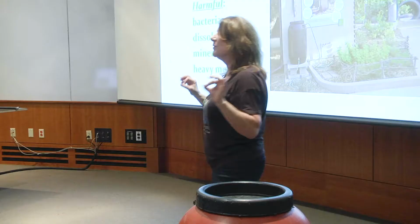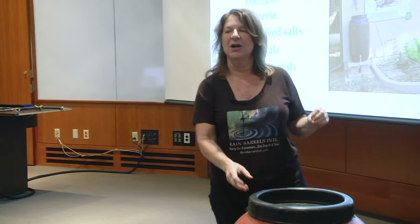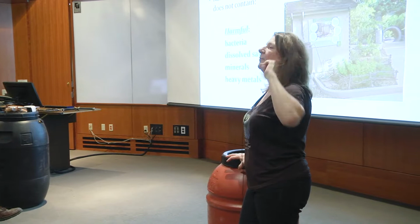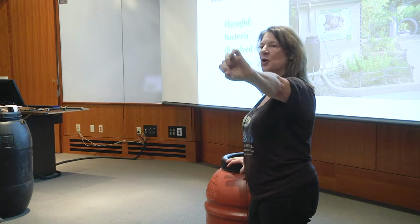But what we would really like to do is have you keep the water on your property. So what we recommend to people is attaching a garden hose to the barrel. And that way, pulling the garden hose away from the foundation of your house, okay? Now, we really are picky because we'd like it to be a 25 to 50 foot garden hose because we don't want mosquitoes to go up the garden hose, okay? So if it's a long enough garden hose, now if you just use a 5 foot section, mosquitoes are going to go up that garden hose, okay?